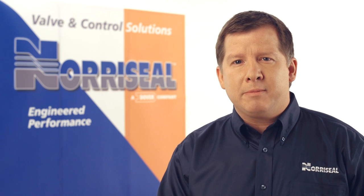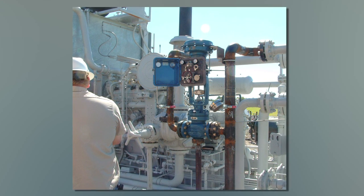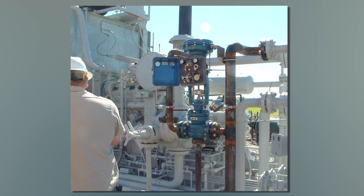Don't install any system components where service conditions could exceed their limits. Pressure relief devices might be needed to meet regulations or industry codes and are recommended as good engineering practices.